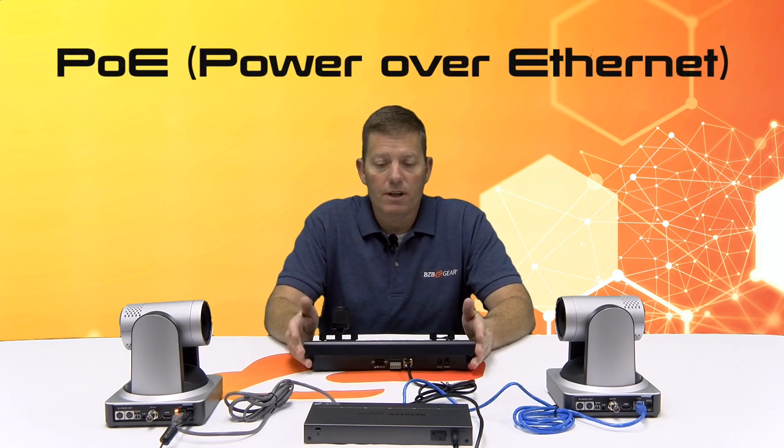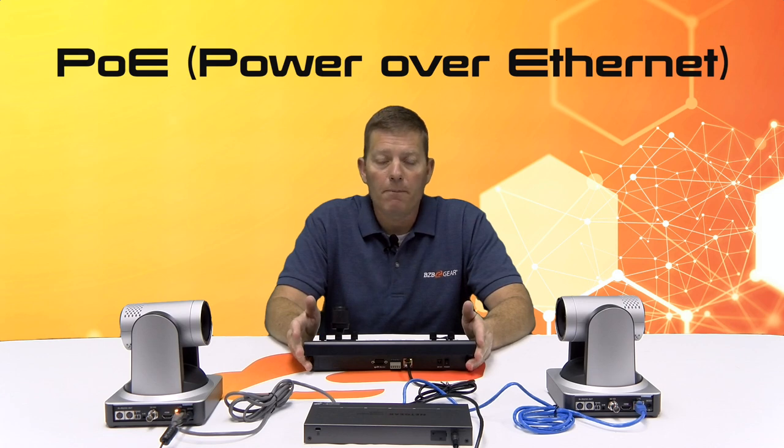This is actually POE which is very convenient, so you don't need a power supply. It also has the option to do DHCP — which is automatic IP addressing — or static. DHCP is very simple. We're going to do a static assignment, and I'll show you exactly where that is as well as the DHCP option in case you decide to go that route.